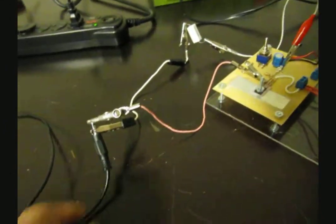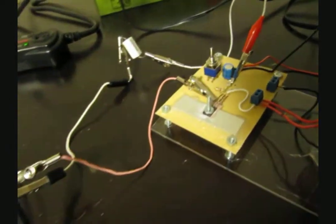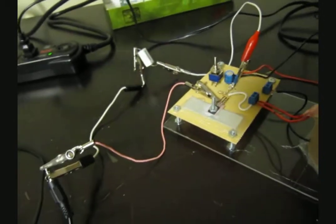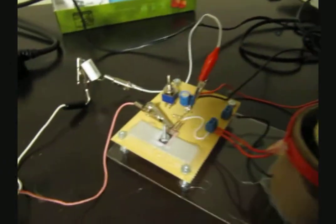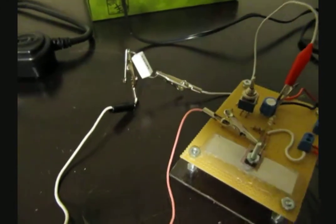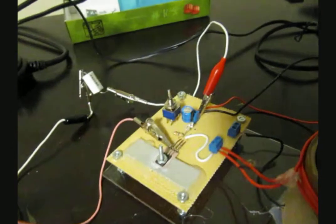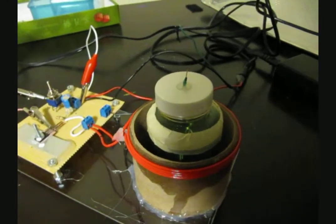I put a switch in the circuit. Initially I tried connecting a CD player's headphone output — one of those lines to the base of the transistor and the other to the negative — as direct connections. I found the Slayer exciter would not resonate when I did that, no matter what I tried. Then I tried a 57-ohm resistor between one of the audio output terminals and the base of the BD139 transistor, and I found that worked, allowing for audio modulation.